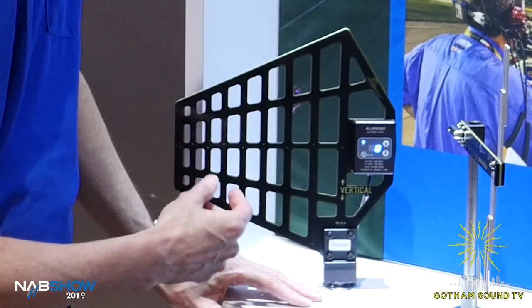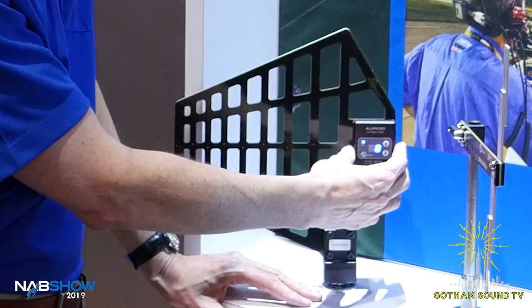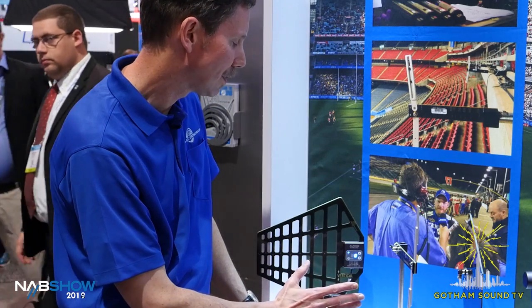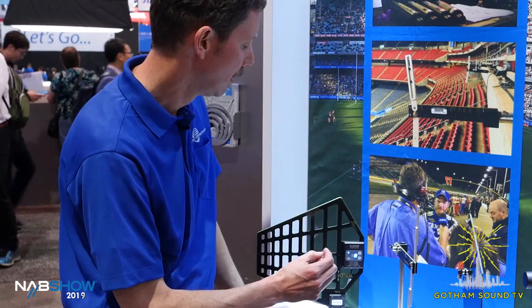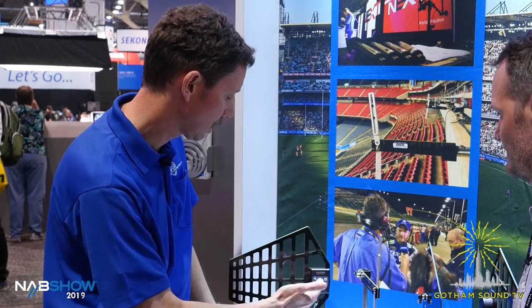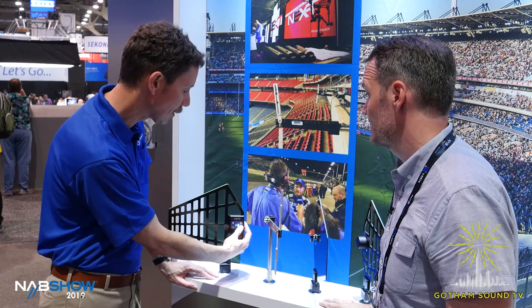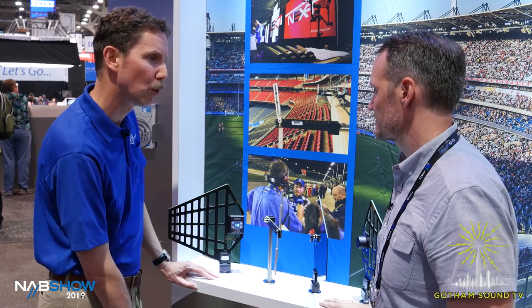So you may ask, what's different? Well, the pickup pattern is the same — it's cardioid in the horizontal plane. But the amplifier is really where the magic is in this one. We've really added a lot of stuff to this. The old 650 amplified antenna, you had to move jumpers around to get your 5 dB, 8 dB, or 12 dB. This one, you can just dial it in right on the display here. I can change it in 1 dB steps for amplification, which gives you a finer-grained selection. And I can also add attenuation, which you could not do with the other one. Where this comes in handy is if you've got short cable runs and you want to knock the level down a little bit, which brings down your noise floor.